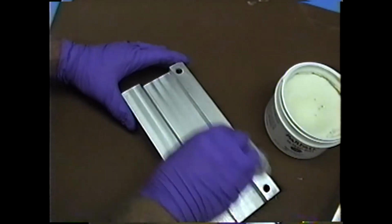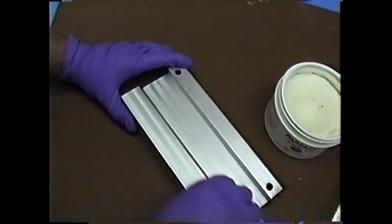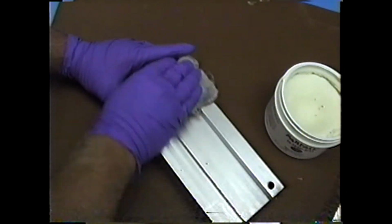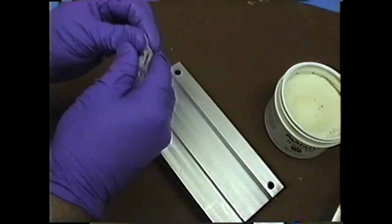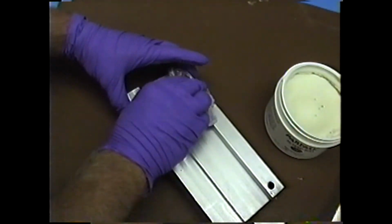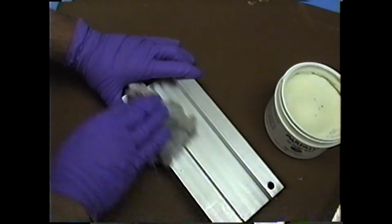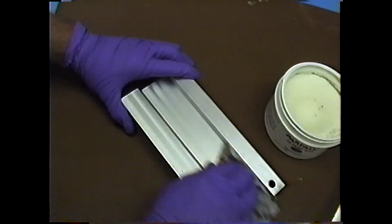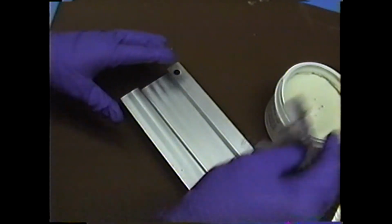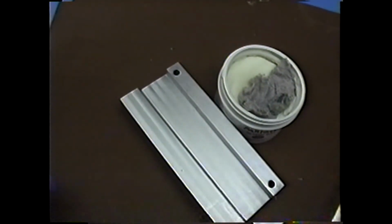Now, we also are going to do some tests in the future. Ed Gallagher has sent us some vinyl ester resin that's made specifically for this application, for making fuel cells. It's very chemically resistant. We haven't tested it yet. But I'm hesitant to change anything that Wayne has come up with because his stuff works perfectly. I've had one of his tanks in the plane over a year already, not one bad run yet. The new ones that I've made in the last 3 or 4 months, every one has been performing well. So I have no reason to try to reinvent the wheel here. I'd like to get this part of it as reliable as possible, and then possibly over the winter run an experimental part and test it for a season.